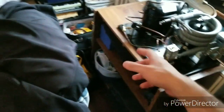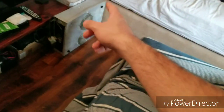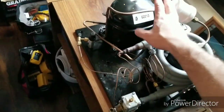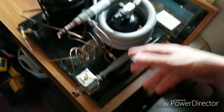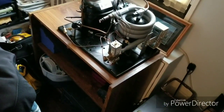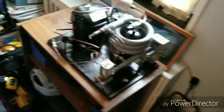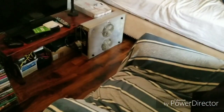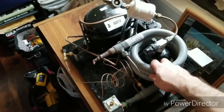This might be the table I'll use. I would put this compressor at the bottom and probably put the evaporator on top somehow. Or I was thinking I'd have it stood up as it is, with the drain on the bottom, and right behind it put the compressor section and just braze the lines. It's pretty much plug and play — you just have to braze the discharge and suction lines. A few things to get rid of, redo the controls, and charge it back up. I'd just have to borrow some stuff from my friend who works in HVAC. I'd need a vacuum pump, nitrogen, a little bit of gas, and maybe a scale so I charge this thing properly, since it's a small system.